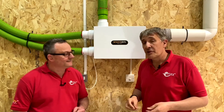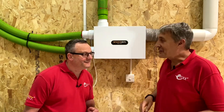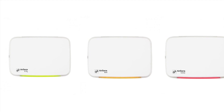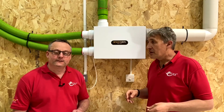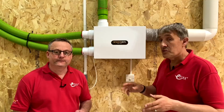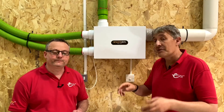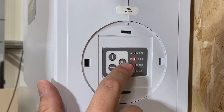With the wireless sensors you can sense humidity, but you can also get a VOC sensor - Volatile Organic Compounds - which detects gases that come off from new furniture and synthetic carpets, which can be quite damaging to health in some environments. Increasingly, CO2 sensors are used as well. We showed that in a previous video, so check that out if you haven't seen those wireless sensors and how they're set up.